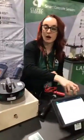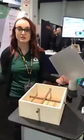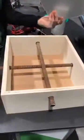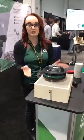So right here we have a bit of a mock-up. What we have here is two rebars. The best way to do the test is to place them where the rebars are intersecting. So hypothetically, this is our concrete cover and we want to do the corrosion rate in these two rebars.